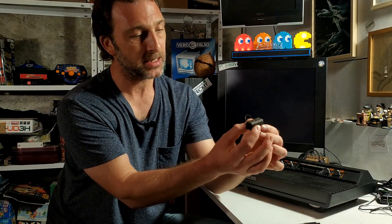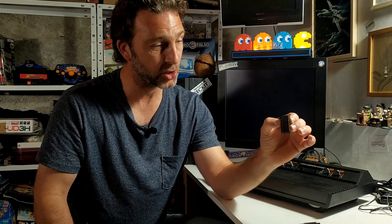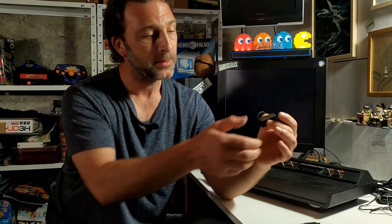Just before we do, the only regret I have is those little 24-pin 4 kilobyte ROM chips still haven't arrived. So we're going to have to use this here - the 28-pin 8 kilobyte chip that we programmed up earlier, sitting in this Frankenstein sandwich of a pin converter device that I made up. This guy is just three chip sockets one on top of the other so that I could wire up the pins so that a 28-pin chip would work in a 24-pin socket.